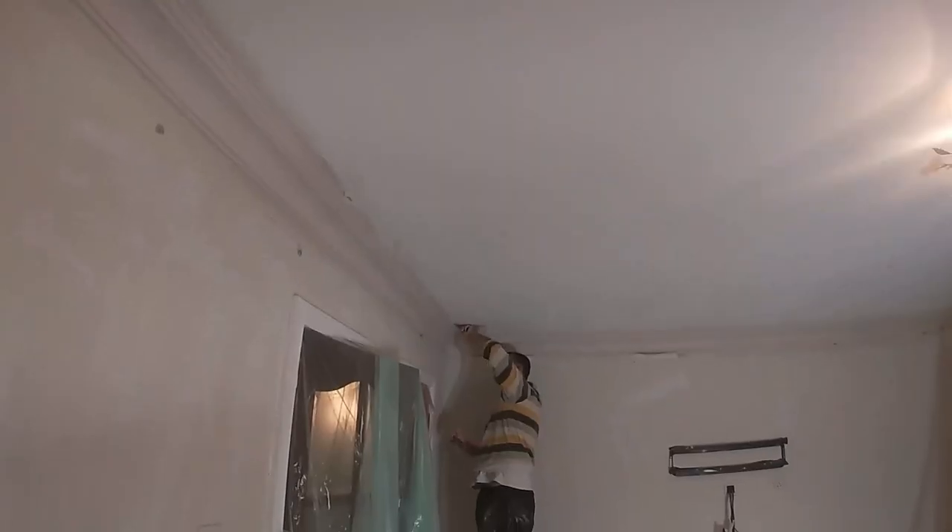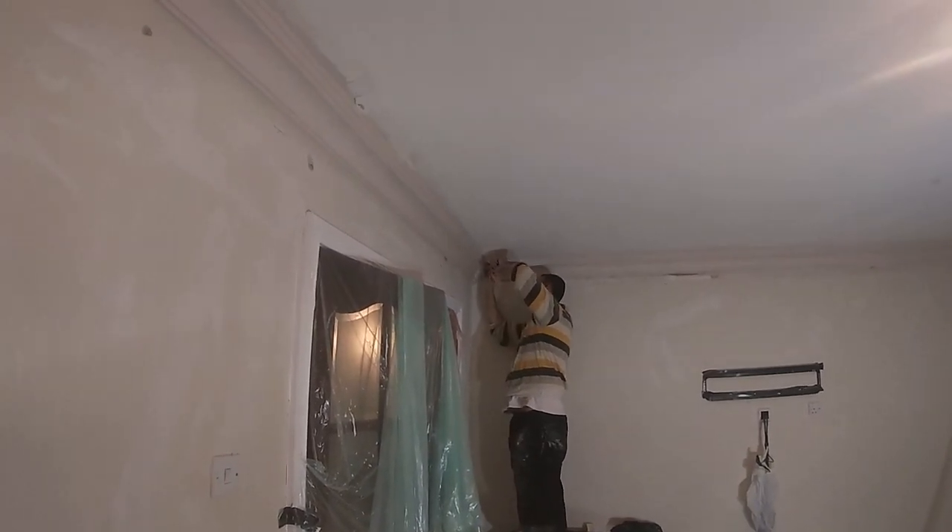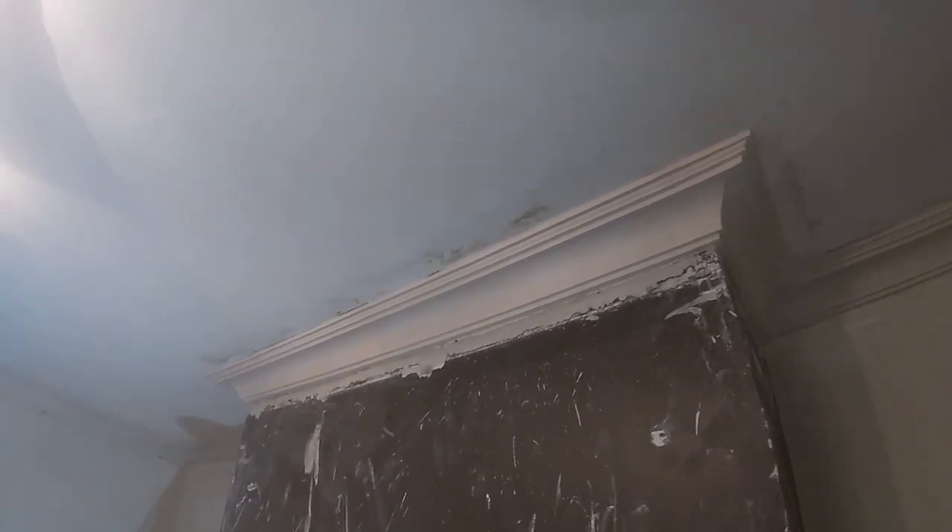You don't have to use a joint rule — you can cut some type of metal to help you shape the corners. This is me just finishing off the last corner, pretty happy about it. In situ it's pretty slow when it comes to corners because you have to do them practically freehand. You can see the holes in the walls from the touch-ups mentioned earlier. The holes in the ceiling — when I'm replastering ceilings any cracks, popped nails or screws, any boards that have sagged all get re-screwed so that won't be an issue going forward.